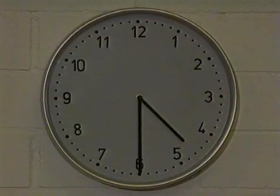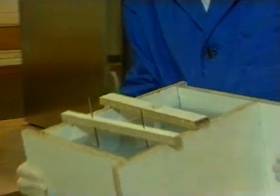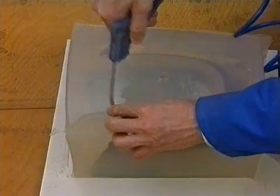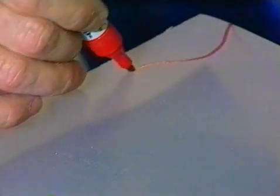The process must be completed within 90 minutes after mixing the silicone because the pot life is running out and the silicone starts to harden. At room temperature the silicone becomes hard within 12 to 15 hours. Tempering it at approximately 80 degrees Celsius can reduce this time to two hours. As soon as the silicone has hardened and the casting frame has been removed, a shot of compressed air is blown inside the mold through the gate so that the mold comes off the master model evenly. Then the mold is cut open with a scalpel along a wavy line.